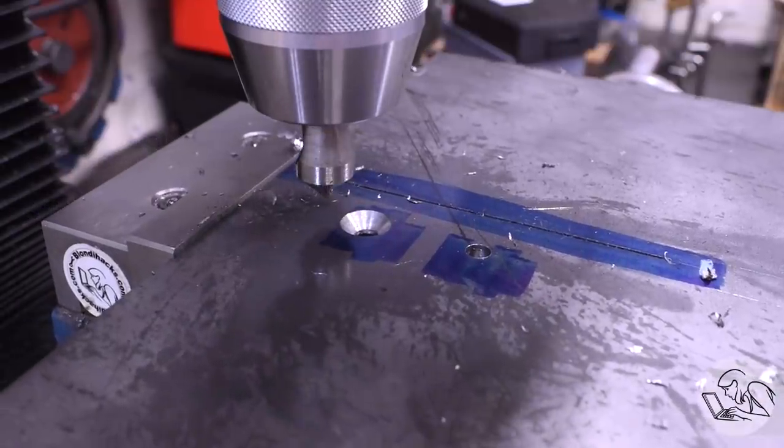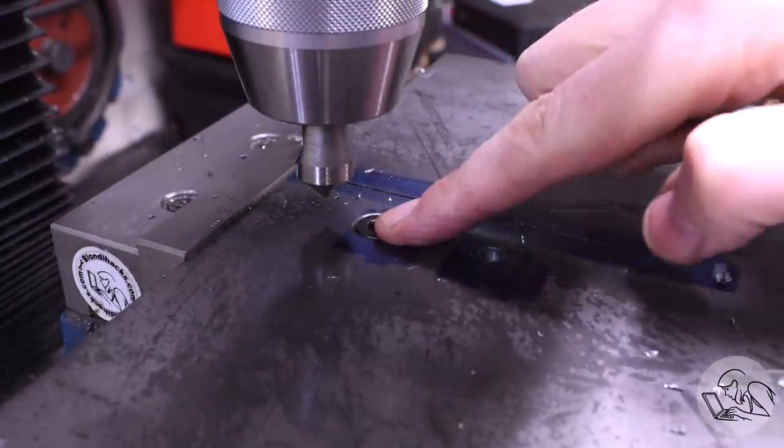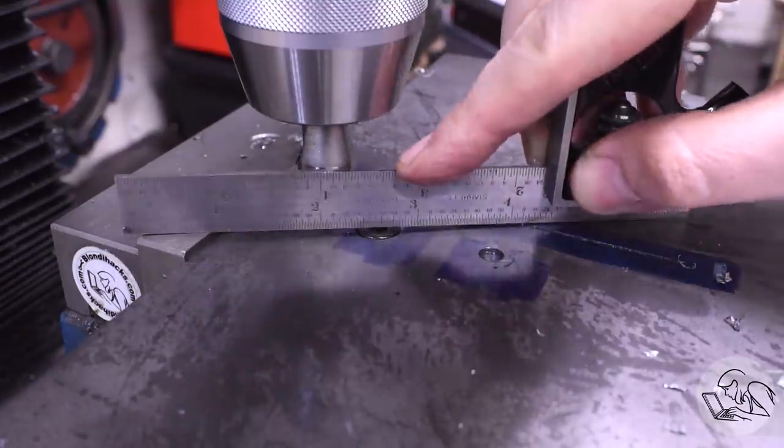These zero-flute cutting tools are kind of magical — they don't look like they should do anything but they actually do a beautiful job. I can just run this all the way down to full depth. The only snag with them is they have a limited range of diameters, so you need a number of different sizes for different-sized hole chamfers. You can see what a beautiful job that does — not even the tiniest hint of chatter even on my wet noodle milling machine. Just double check that we are sufficiently flush or below the surface, and we are.